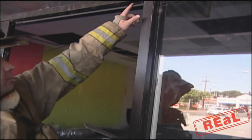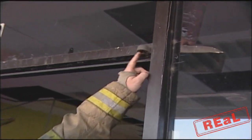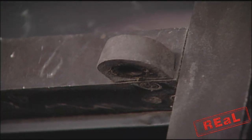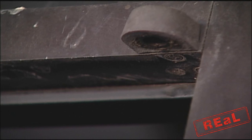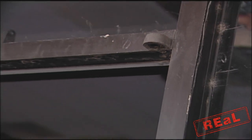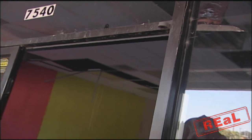If you look at the top hinge, the top hinge has a hole where the bottom one has a pin. So when you put this door back in place, you've got to slide that pin in, set the mortise and lock throw back in, then slide it back on the bottom pin — that's how we do it. The reverse of how we took it off is how we put it back on.